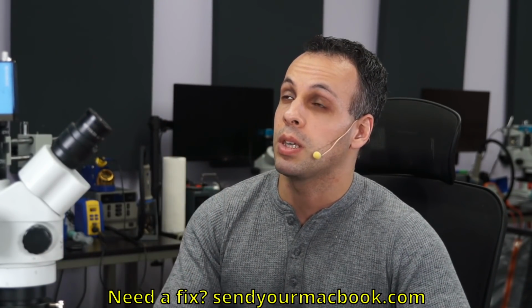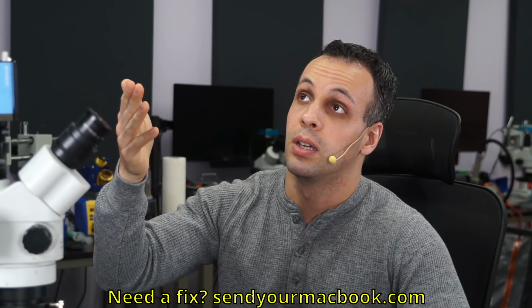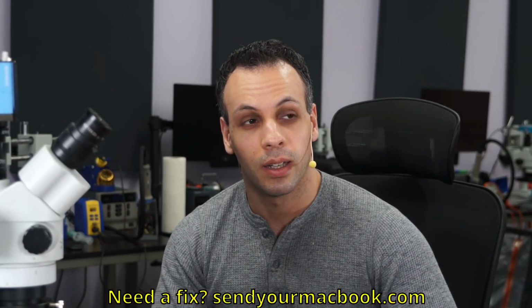We see, oh, it's PP-Vin, PP3v3, that's missing. Oh, where does that come from? That comes from PP-Bus G3 hot. Okay, that's missing. Why is it missing? Short to ground. Let's find the short to ground. We found it, we fixed it, and it works again.